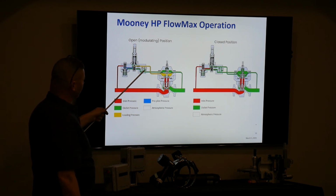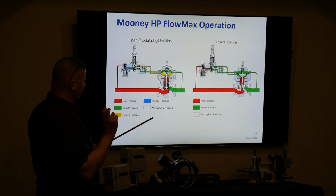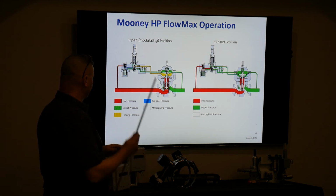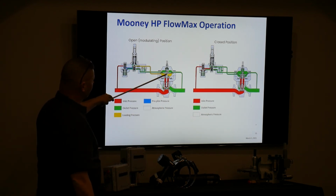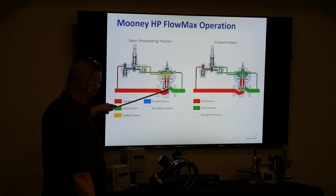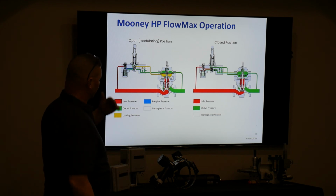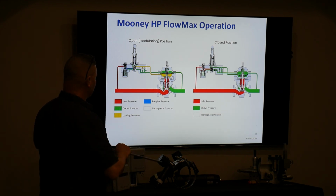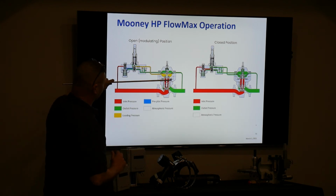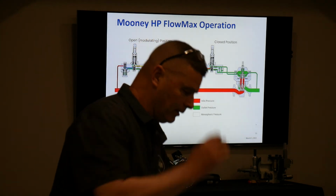And then you have a little adjustment on the side of that restrictor, which is the Type 27 restrictor. You have a little adjustment for proportional band like you do on the Type 24, so it gives you the ability to adjust responsiveness of opening and closing. But the pilot then delivers the gas underneath, just like on the other one, to that assembly that lifts the piston and lets gas flow out that port. You still have very fixed separations, and when you do maintenance it is very easy. You can basically just do the top. You can pull the whole top works off, and the stem comes out, and you can do maintenance on the piston or in the area of its seal.